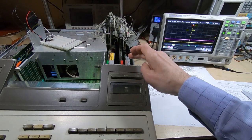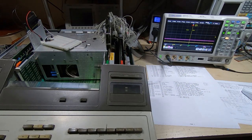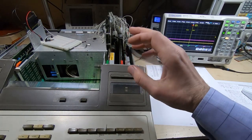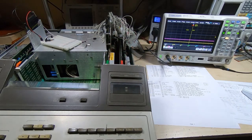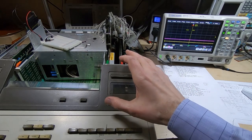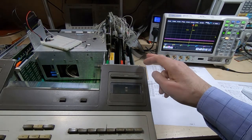What's happening is the LPU isn't going through the startup properly, but the result is it thinks it is — we'll look at this in a few minutes. When we try to look at the PPU, it's just not doing what it's supposed to. Because the main monitor program that drives the system is in the PPU code, and that's never being jumped to, the system effectively doesn't start up and remains in reset. There's no activity on the CRT driver card, all the counters are completely dead, and the same is true of all other parts of the system — apart from the code in the two hybrid modules continually looping around trying to start up and failing.